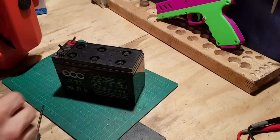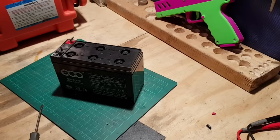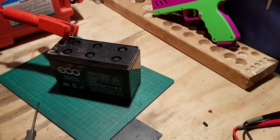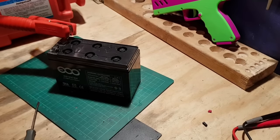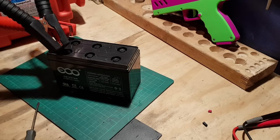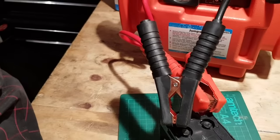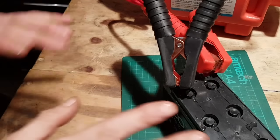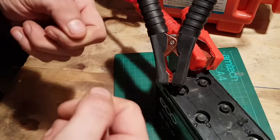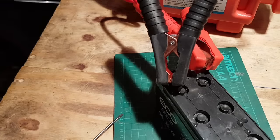Remember we were sitting at 5.2 volts. We're going to take the jump start kit and rig it up onto the positive — always put the positive on first and take it off last. And there it is on the negative. Mine are just grabbed onto the terminals. Sometimes they're screw holes where you put little ring clips and screw down into the terminal, other ones have buck connectors, other ones are soldered on. These were soldered, so I'm just pinching onto the points.